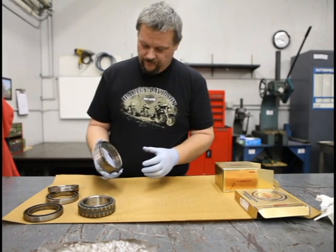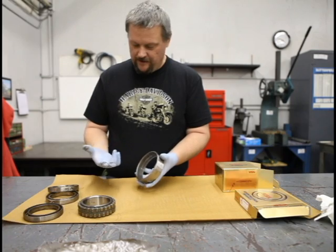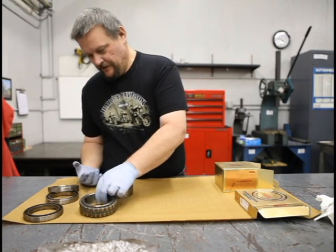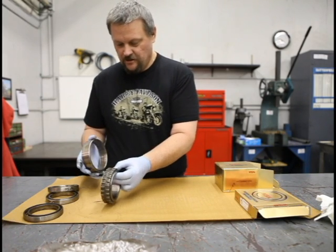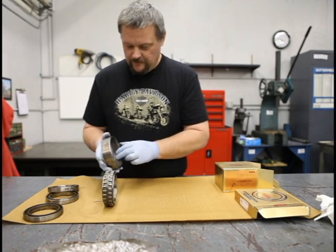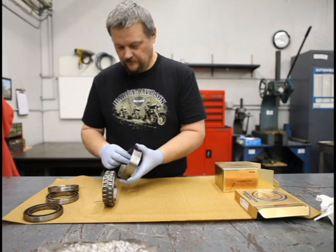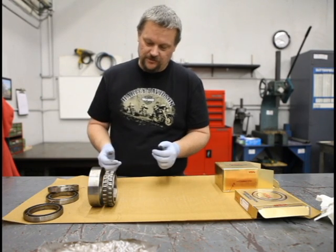This is a roller bearing. This roller bearing has also been contaminated — you can see by the amount of dirt and coolant that's in the bearing. What it does is it causes the rollers to cloud over and causes them to turn rough inside of the outer race. It generates heat and just causes premature failure.